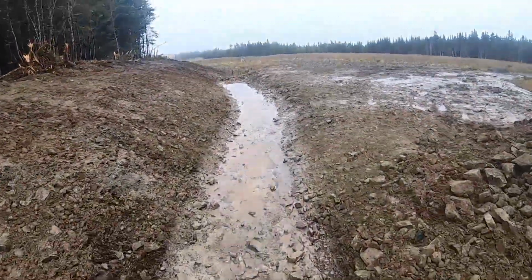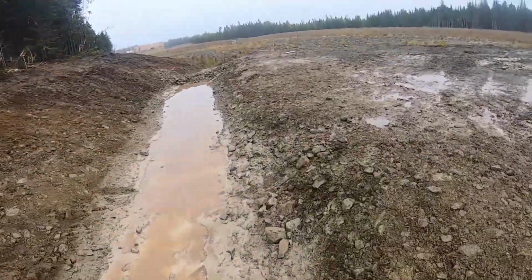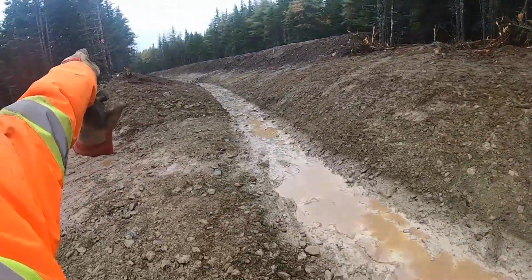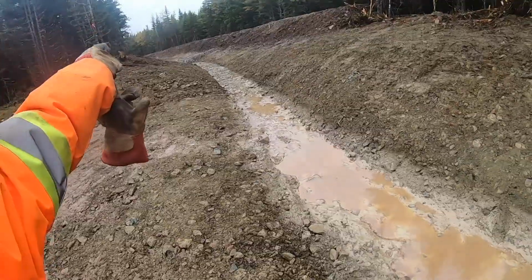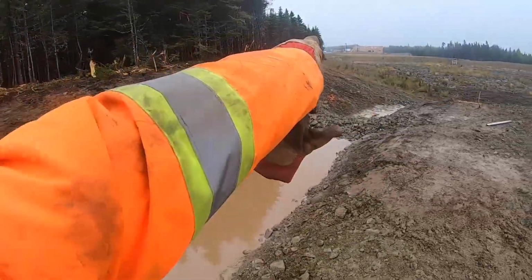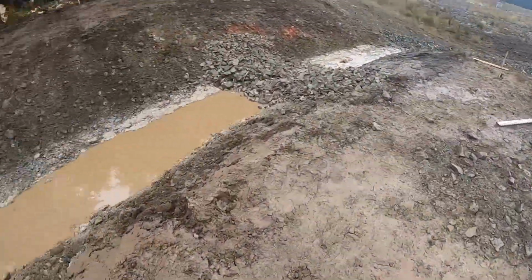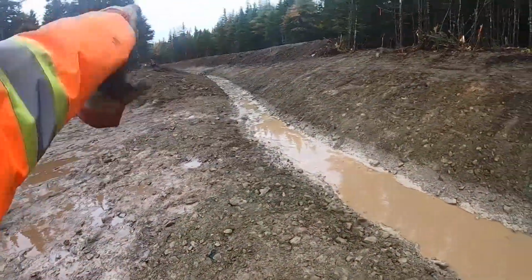This is being hydro seeded today. Once we get finished off up top, the hydro seed truck is going to do from where we're located up there now down. I think they said the hose is 400 feet. So coming down, there was a tree that was spray painted orange. That's the 400 foot mark. So we're gonna go up top where we're to, as I was saying, and come down as far as there. Then they're gonna come down over here and they're gonna drive their truck in across over here, in the right here, and they're gonna park it here. And they're going 3 meters on both sides, up 3 meters on this side, all the way up with hydro seed.